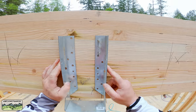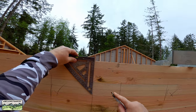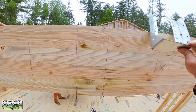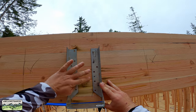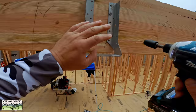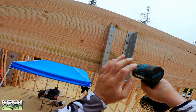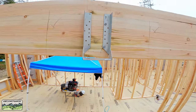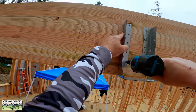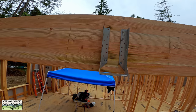This is not an advertisement for Strong Tie, though they have sponsored some videos and all our hardware happens to be Strong Tie. In this case it's a concealed hanger for a five-and-a-half-inch-wide glue lam across the kitchen that we'll pony wall up to and support our 24-foot rafters. For high-capacity hangers like this I like to buy the ones that come with SDS screws — they install a little slower but you save time if you have to move it, you get higher capacity, and it's easier on the body. Little impact drivers like this are really lightweight — no hose, no cord, no extra gun.